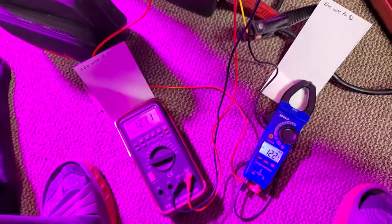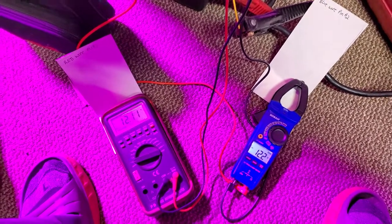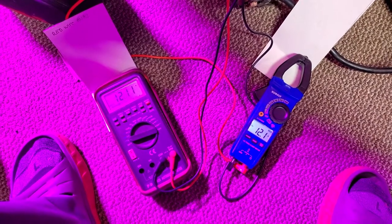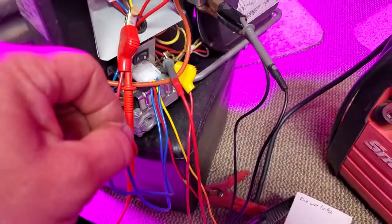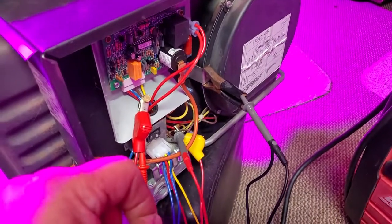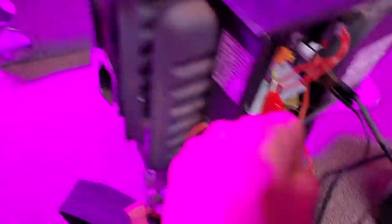This is how you troubleshoot this circuit. We're going to go over every other circuit too, like I did on the water heater for you. Later on I'll show you there's a control board wiring harness you put on the control board — it's to extend the life. You bring it outside that metal cage, it's easier to troubleshoot.